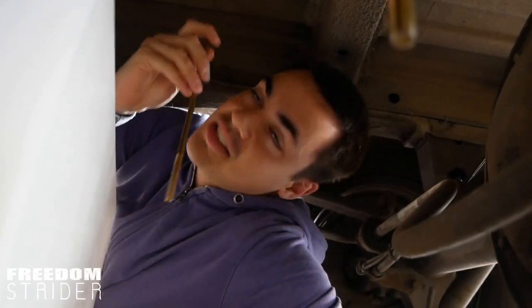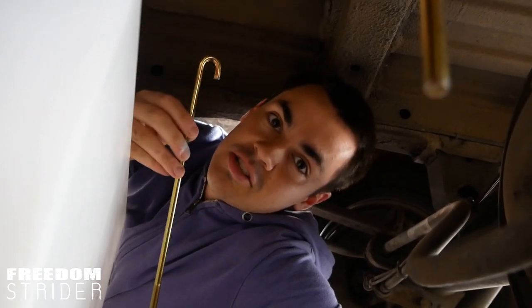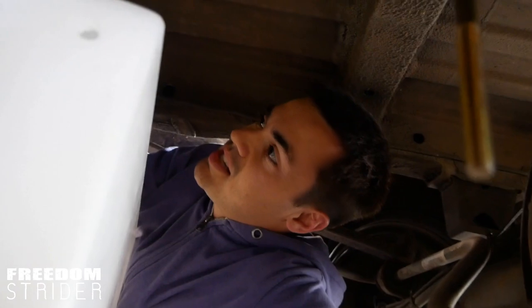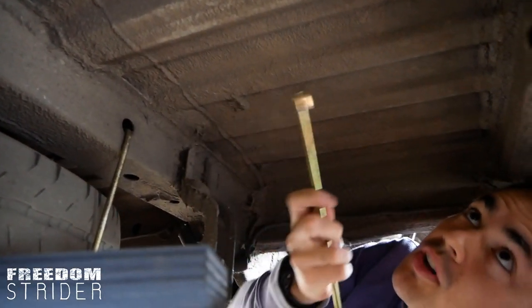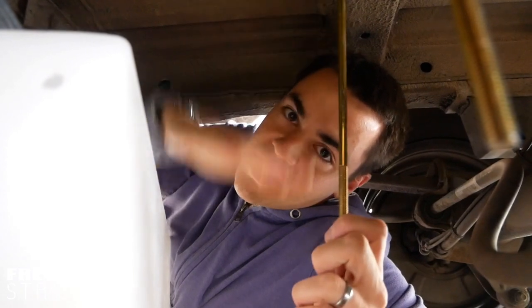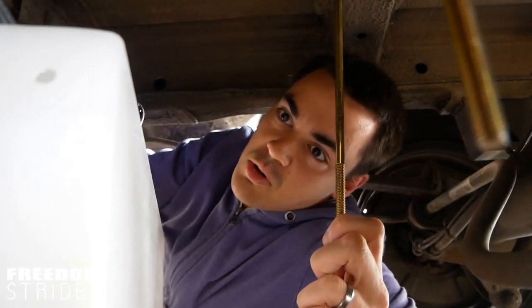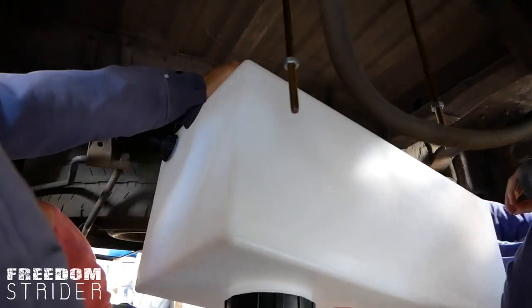To attach the tank to the underneath of the van, we're going to be using these, which are called J-bolts. I'll leave a link in the description, but essentially they have a hook on one end, and we're going to use the existing holes in the chassis to hook these J-bolts on. So there's actually a hole just in here. So we hook that on there. Then we'll push the tank up and put a steel plate below, attaching the two J-bolts together, and that should strap the tank up against the van.